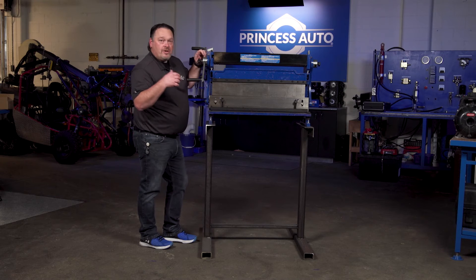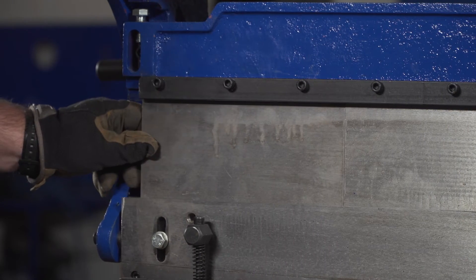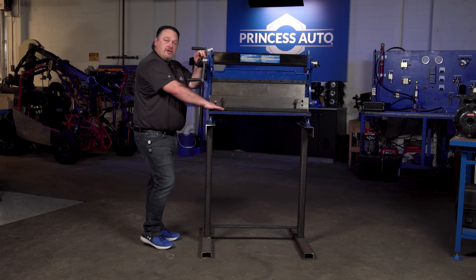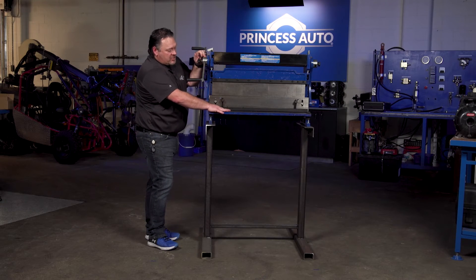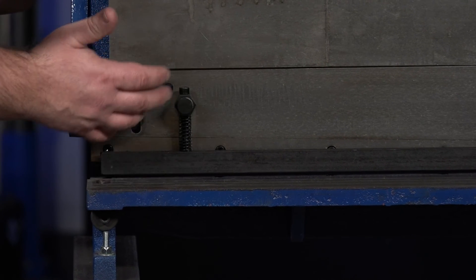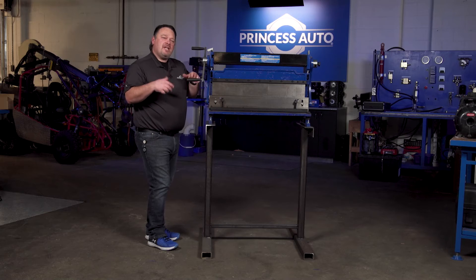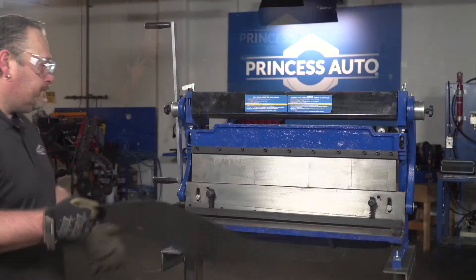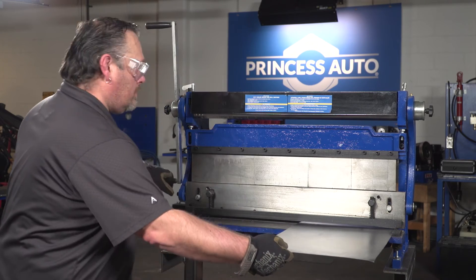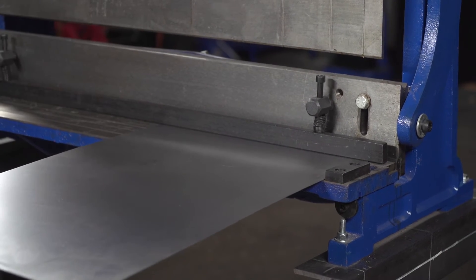The brake allows you to do up to a 90 degree bend. If you need to do a full sheet, you just add in the different plates with your Allen keys. You also have a shear down below — there's the bed for the shear, and there's a guard that needs to be adjusted as you use different size material. About 12 gauge is as low as you want to go on this — if you get any thicker, you may start to bust bolts, springs, or even bend different plating.